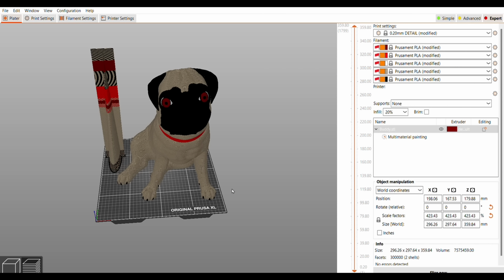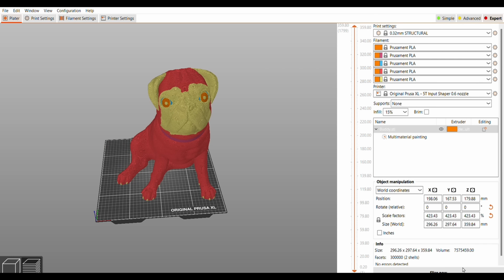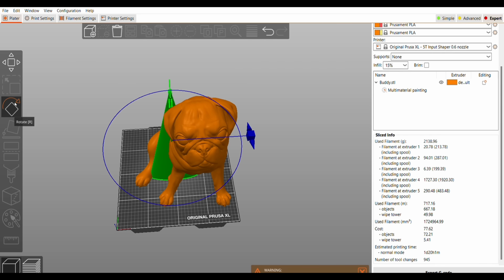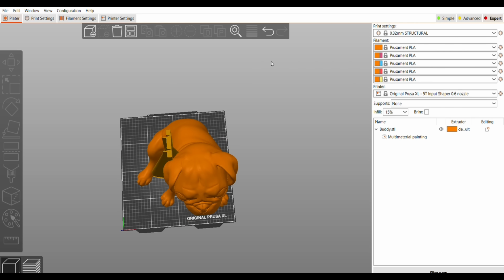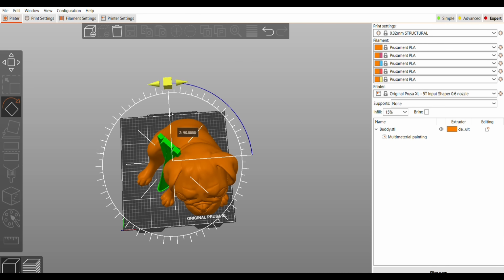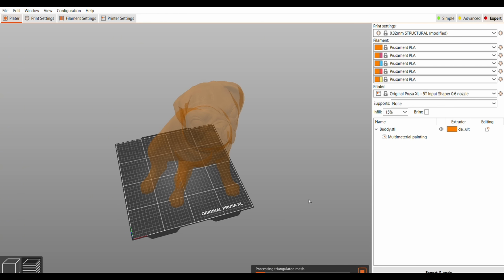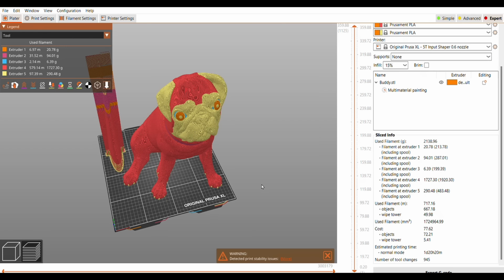So I'm going to change my settings now, go to Input Shaping, and then also change my layer height to 0.32. And I figure that that's fine because that's what the last one ran and it worked out with no problems. I feel like if I change just about any settings on this, I have to move my tower. It seems like it either wants to pull up in the middle of my print or so far back on the build plate that it gives me an error. So I just move this around, and this is a lot of improvement.